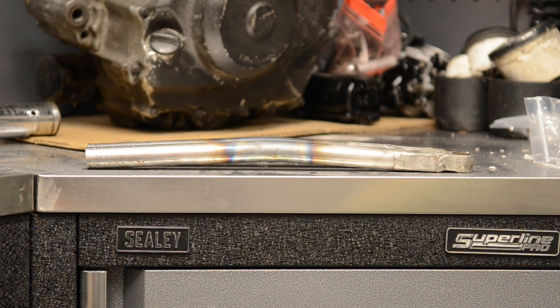Here's the final result on my tube bending - as you can see it can be done using a propane torch. Most people would have access to a propane torch, so it can be done. You do need a long tube to pull it over though - you wouldn't do it with pliers, plus it gets so hot you couldn't hold it. This was either this or buying a tube bender, but most tube benders wouldn't bend a pipe this size. This is 22mm and you're getting into the bigger benders which are around a thousand euro - that's an expensive pastime for just a small bend. So this is quite a nice and cheap way of bending a pipe.